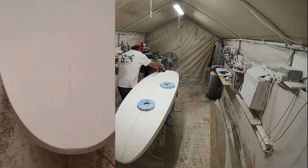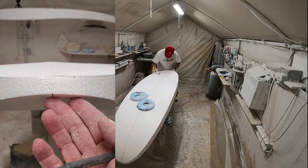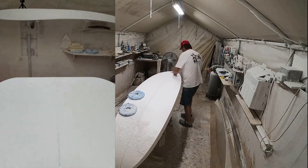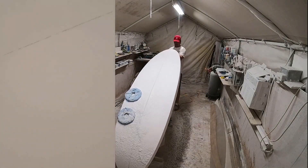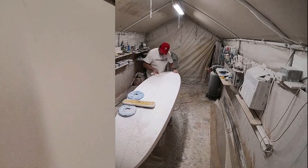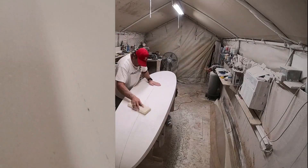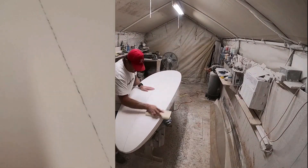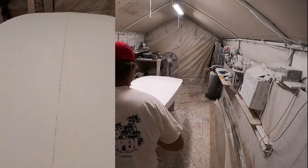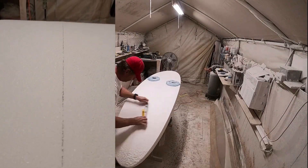As you can see, I've got the V in now. If I lift it up, you can have a look - the V is in all the way through to the middle of the board. I'm happy with that V, it's blended very nicely. Very important when you're shaping: try not to get rid of your center line. It's only a light pin mark, but wherever I can I can see that center line hasn't been touched. One of the biggest things in shaping is to make sure your center line stays where it was, because that is actually your design - your template that you've tried and tested.